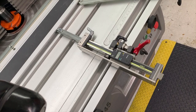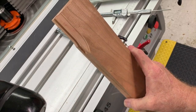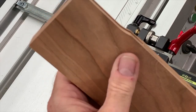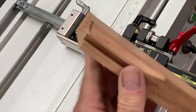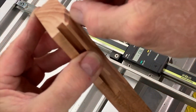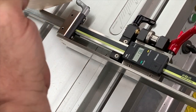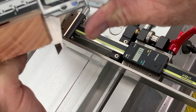I'm going to run another test cut just to prove we got where we wanted to be. Here's the second test cut — you can see we're getting a full profile being cut into the material. We've got this dished-out section there. I actually moved the spindle up a little bit to reduce the profile height for that little ridge. Let's check our final width: 68 — right on the money.